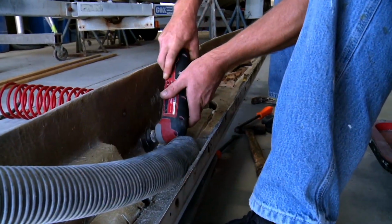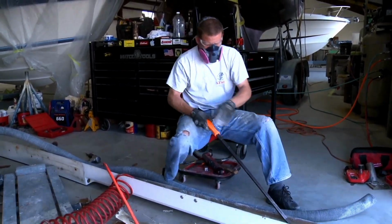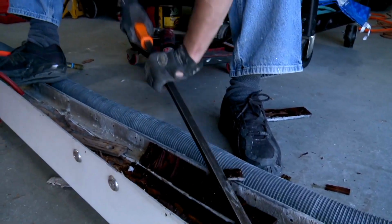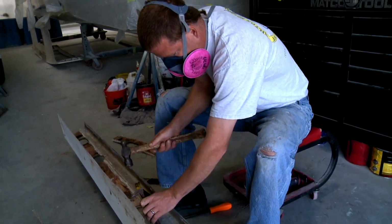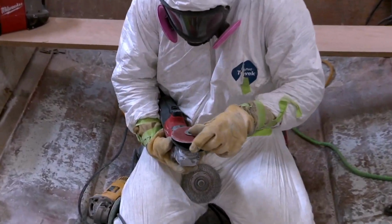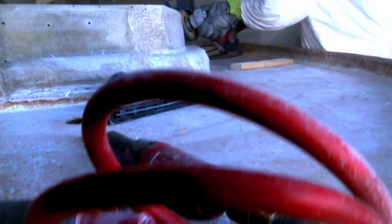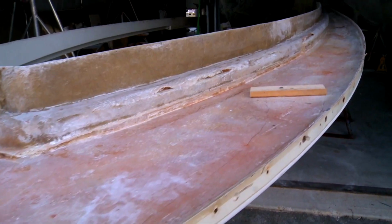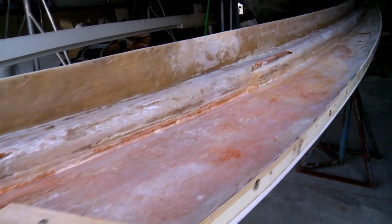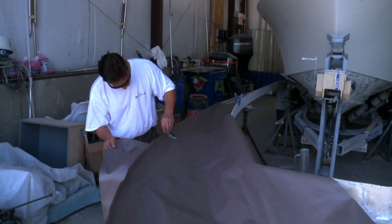The men cut along the edges of the laminate and easily removed the delaminated fiberglass from the rotted wood surfaces. Then scraped and chiseled the rotted core from the inner laminate. Then they gave the deck lid a detergent and solvent wash, letting it dry out for a few days while they made the templates to fabricate the new core.